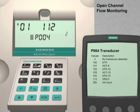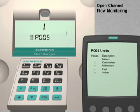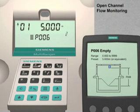Press the Up Arrow key to go to parameter number 5. Parameter 5 sets the units of measure for all dimensional values. The factory default for this parameter is meters. Since this is the unit of measure preferred for this application, we will leave it set to the factory default value. Use the Up Arrow key to go to parameter number 6. Parameter 6 is the empty distance value. For our application, this distance is measured from the transducer face to the bottom of the V-notch. This distance is 0.9 meters. Enter 0.9 followed by the Enter key to set this value.